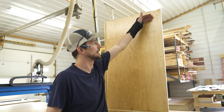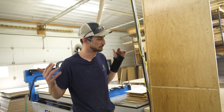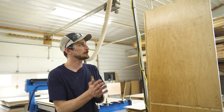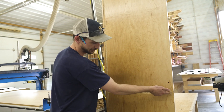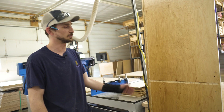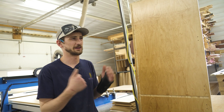Our designer has really gotten the grasp of everything — getting our hinge holes in the correct places so we're able to use pre-mounted hinges, which is just making us quicker and more accurate. This will cut out all of our dados, and we're changing the tolerances based on our new plywood. Tolerance is just the amount of play that you have when you slide a corresponding piece of plywood into this groove. Dados are used in cabinetry often — it's a very sturdy style joint — that's how we fix most of our partitions inside of our cabinets. We'll have adjustable shelves as well.